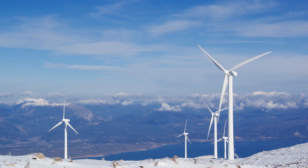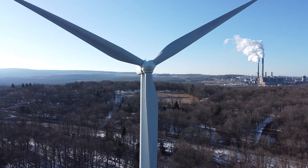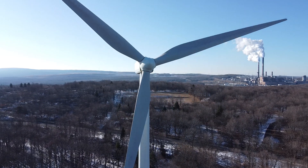The third area we see is just general wear and tear. You would like to have those wind turbines running continuously through rain, snow, sleet, hot temperatures, and cold temperatures — and all of that has an effect on your lightning protection system. It can remove some of the grounding and bonding features, which become higher resistance over time. More importantly, your lightning protection system just isn't as efficient as it once was because of all the weathering.